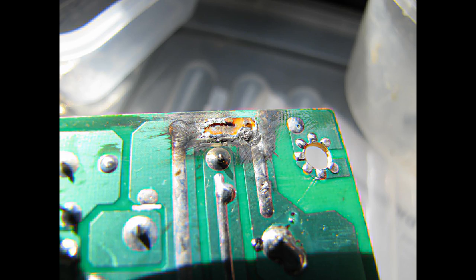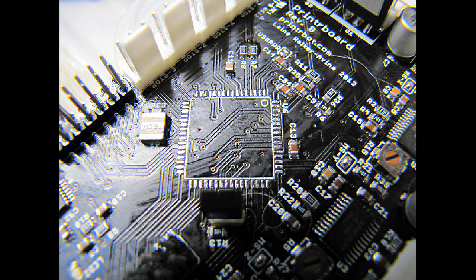Next day the power supply blew up. It vaporized 3 millimeters of track inside. It took out the house circuit breaker, and unfortunately it's blown one of the USB pins on the printrboard micro, so I'm waiting for new parts to either repair or replace the printrboard. Then you will see some more printing.